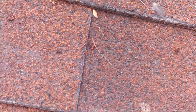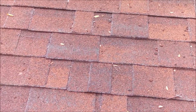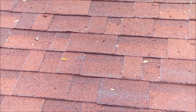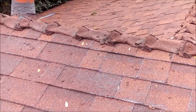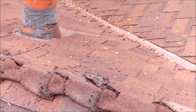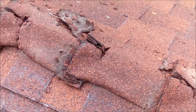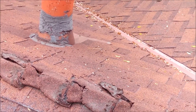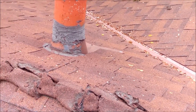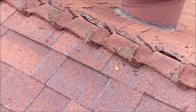You probably have another eight years or so on the roof before it needs to be replaced. The ridge cap — the very top of the roof — those shingles need to be replaced ASAP, or yesterday. That will need to be done before the next rain season.